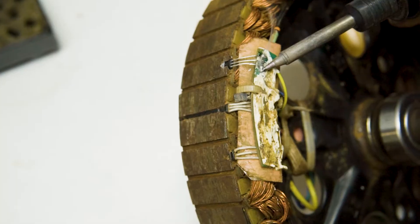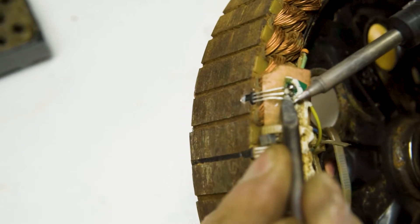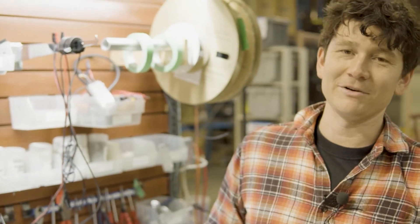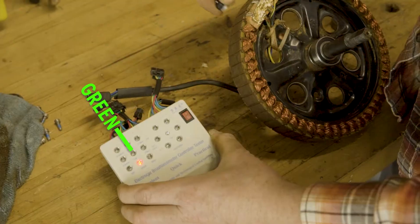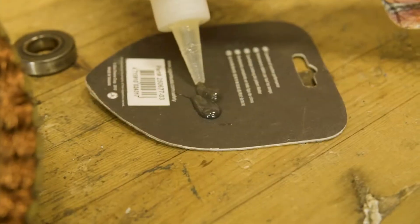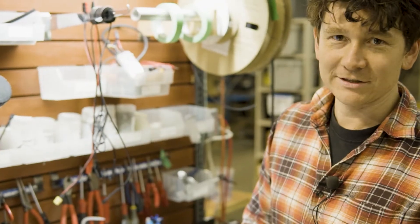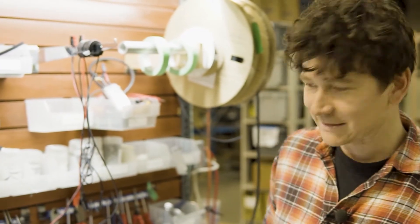I went ahead and soldered the leads on the top surface of the hall board rather than going from the underside like the other halls, just because it's way more accessible. We just want to make sure the hall sensor actually works, because it's super annoying to go through the whole process of gluing something down only to have to take it apart. We have our green and blue and yellow all toggling. Instead of heat shrink over the legs, we're going to slather all of this with some five-minute epoxy to totally encapsulate the legs and protect them from corroding should this motor fill with water again — which hopefully it won't.